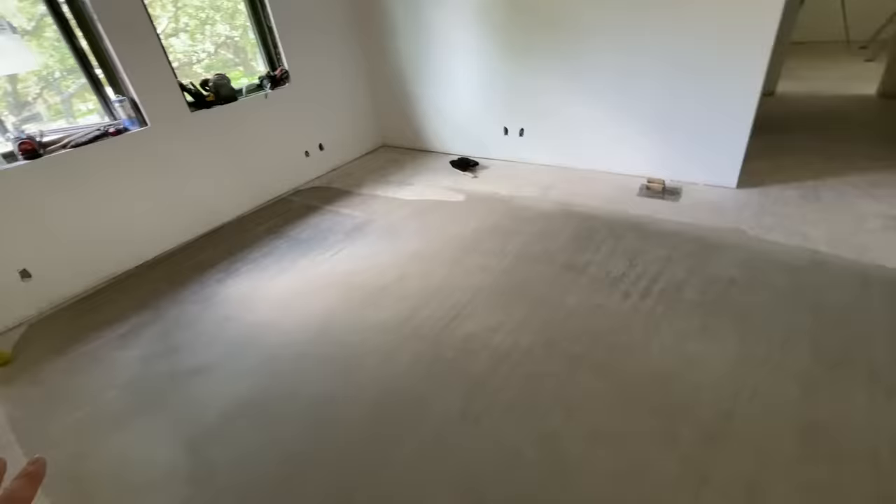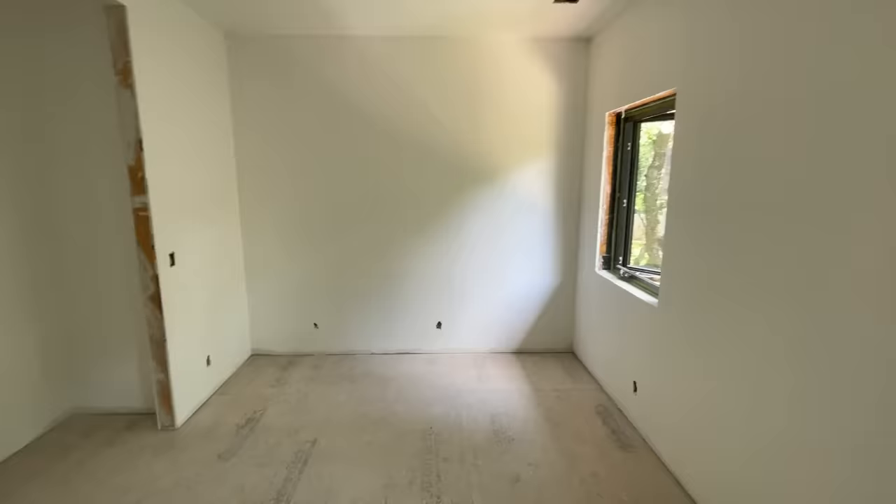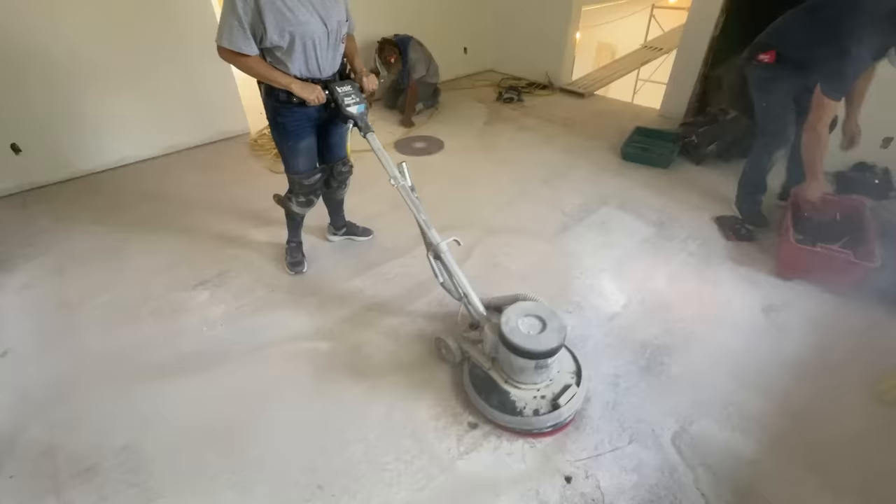Christine Hardwood Floors, my local contractor installing these Delta Millworks floors - which are available nationwide - has done an amazing job of prep. Let's start in my daughter's bedroom. I did not cover my Advantec prior to sheetrock upstairs, which meant a fair amount of prep was needed. They used a buffer with a 26-grit sanding pad. Wilson and his crew did a quick buff of the floor.